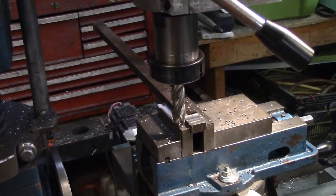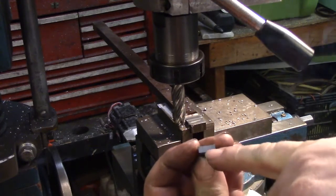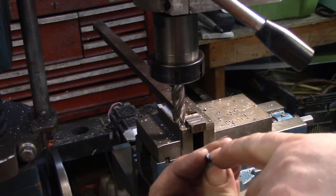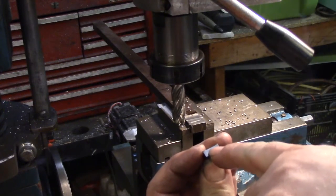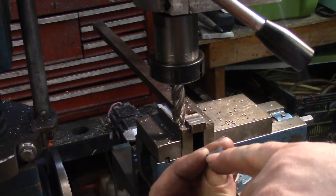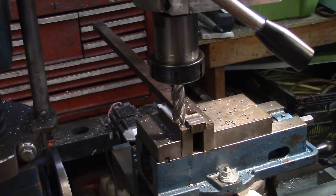Why am I taking off the top of the metal? Well, if you look at that sucker, you see that dish. I don't want my pocket wall to come above the lowest spot where these edges come in, because I don't want any cracking or damage to start on any of the cutting edges. So I want my wall to stop just short of the lowest point, and that means these points are going to sit proud.